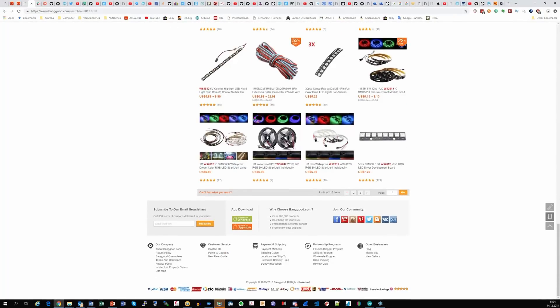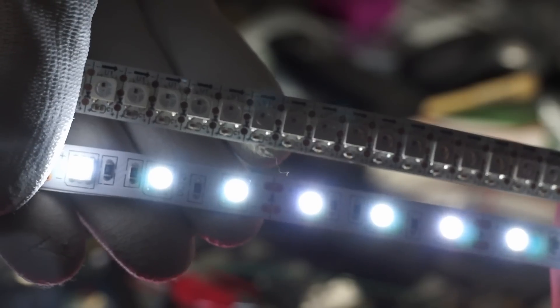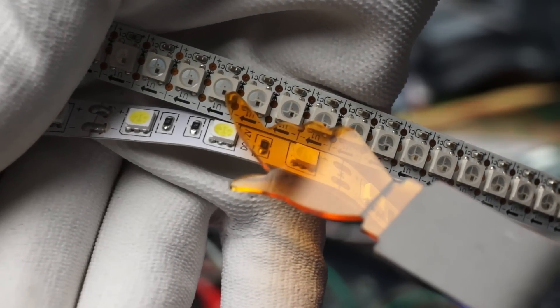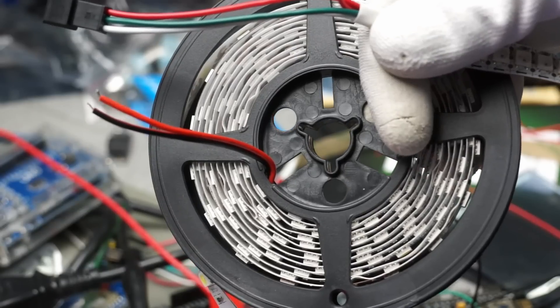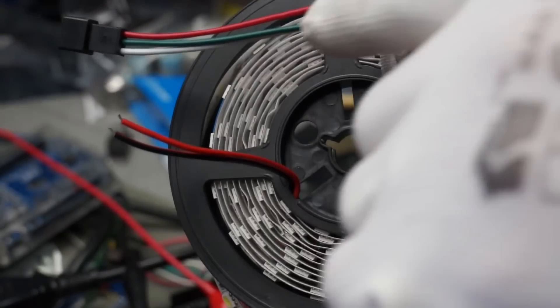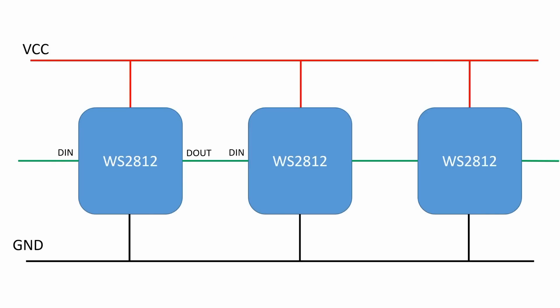Let's start with a simple strip. Tip or trick one: you can buy very similar-looking strips with only white LEDs. You can easily distinguish the two — white LEDs have no black point inside the case, and the strips just have two wires instead of three. The third wire on NeoPixel strips is the data wire. In reality, NeoPixels have a fourth pin — data out — which is already connected to the next pixel on the strip. You find the last DOUT wire at the end of such a strip; it could be attached to the next one.